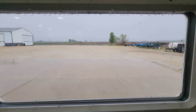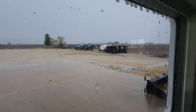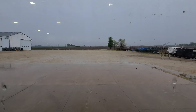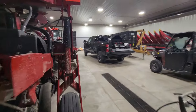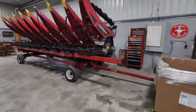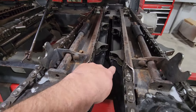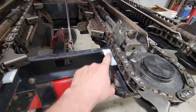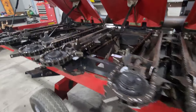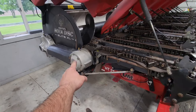Good news — it's the next day. It rained more, been raining since last night, pretty much all day — it's freaking great. But let's update what's going on: the corn head is completely done. Callan got all the new deck plates on, all the new gathering chains, and the wear skids. This thing is ready to get put away and ready to rock this fall.